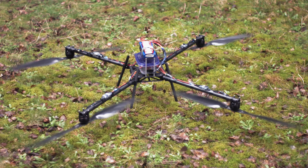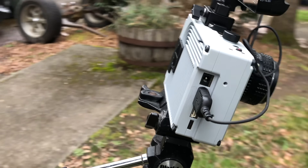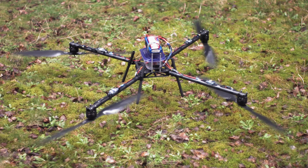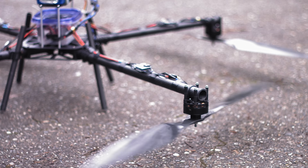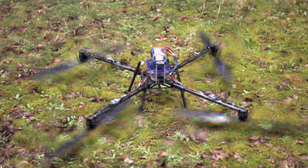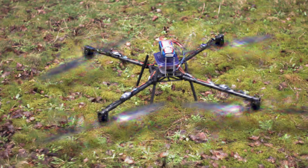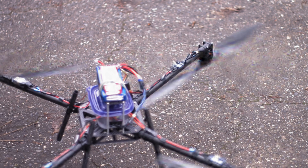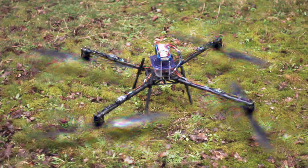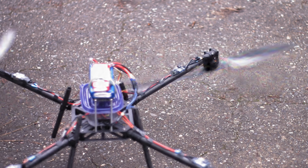Before I had taken the big props off and built all the foam around it, I filmed it with the FreeFly Wave camera to see the props spinning slowly but in slow motion. After playing back the footage, I noticed how suddenly all the vibrations were visible — you can see the battery wires shaking, the entire battery itself shaking on the cantilevered battery tray, and the booms also shaking quite a lot. It's pretty cool to see everything vibrating that you can't see with your bare eyes. FreeFly also has a software feature called Amplify that finds what's vibrating and increases the movement of just those pixels so the vibrations are even more visible. The Amplify software would be super useful for studying vibration if you're doing design and development work, and at the least it's just super fun to play with.